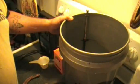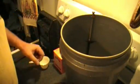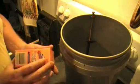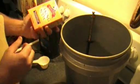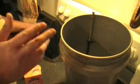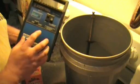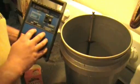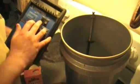Let me go through the stuff you're going to need to set up your electrolysis. Some kind of container or bucket — we'll get to that in a minute. You need some kind of sodium bicarbonate — Arm & Hammer baking soda, or even the cheap stuff works. I got this at a dollar store, like two boxes for a buck. Got my measuring cup. Now, when it comes to powering your electrolysis setup, I've got a Cornwell charger here. This one will still work without a battery being hooked up to it. Any of the new chargers will not work without a battery, but this one does. It's got 2 amp, 10 amp, and 55 amp boost — which we'll never use. I usually do my stuff on 2 amp.